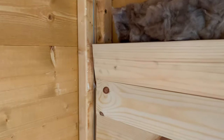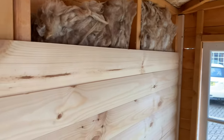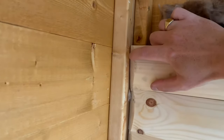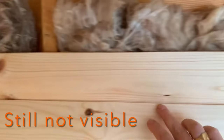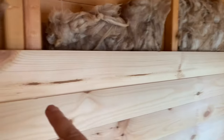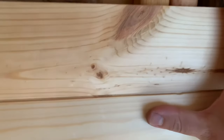Sometimes you'll find that the planks have a bit of a twist on them and actually need pinning in. They're okay at one end but need pinning in with more than just a little nail, so put a screw in the end section to really pin it. This one also has a bow on it - it's flat down at both edges but not in the middle, so when you come to put one in here you can just pull that down and close the gap up.